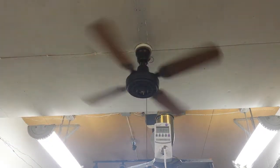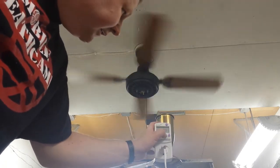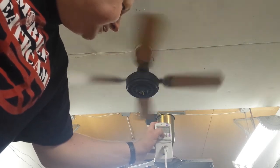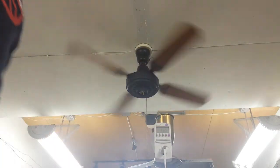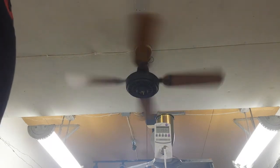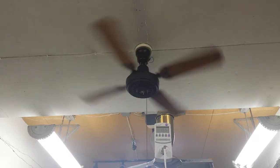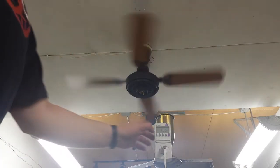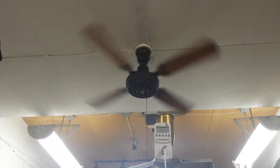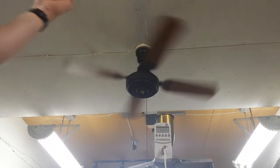And the power factor on factory low was what, 1? Yeah. So the power factor on this is 0.36. So what wattage is it drawing? 15.5 watts. But was factory low faster than that, or about that speed? It's about that speed. So in other words, it's much more efficient to use it through a capacitor for the low than it is to use the factory low, which doesn't surprise me because I believe these speeds are derived from coil taps, and there's a lot of wasted electricity when you have coil taps. A lot of SMC stuff I've tested is like that too.